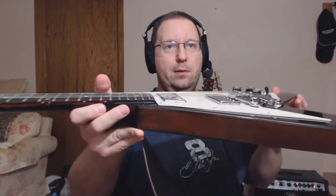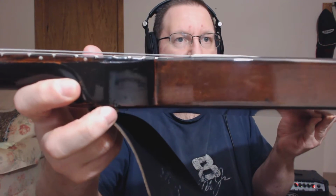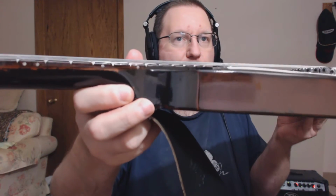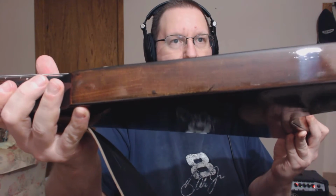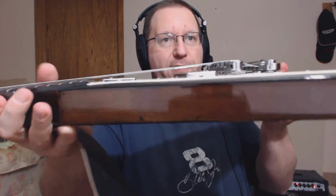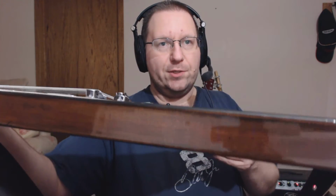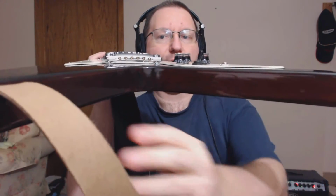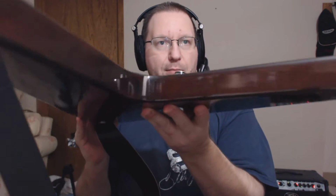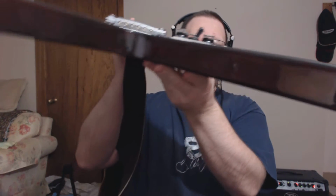The body here on the side, you can still see the little nick in the body, which actually filled up with the true oil. That is actually the original body. You can see the bit of reflection in it from the true oil base. Now what I did was I actually committed the original sin in regards to, say, some Gibson folks, and for further protection, I did 3 coats of Minwax wipe-on poly, just to give a bit of hardness.